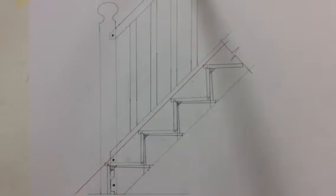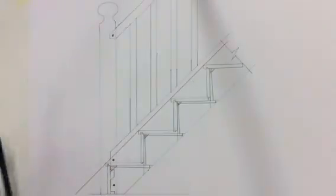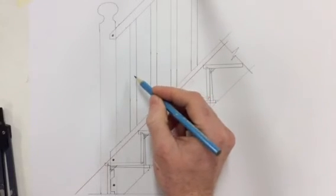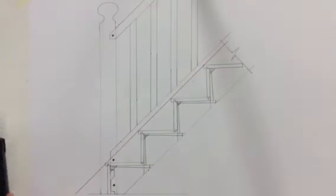If you wanted to highlight to the examiner the 100 millimeter sphere there, so if you were to draw, 100 is your diameter, so 20. Now, if this will work. So I have my compass set at radius 10. No, the lead isn't deep enough in it. Alright, so if I was to draw in a circle there, radius 10, so diameter 20, it should be fitting outside of those lines. So it shouldn't actually allow it to fit in between the gap here and here and here, for example. Alright, so you could highlight that on your drawing as well.